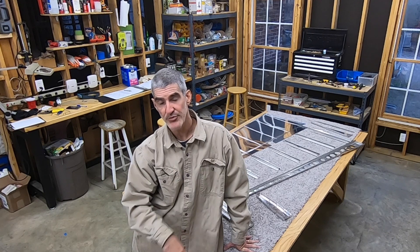I've completely disassembled everything. I've deburred all the holes in the skins and the skeleton, gone over the edges again, made sure those are all nice and deburred. The whole thing took me about three hours or so. I'm going to go ahead and start dimpling the skins now. I'll use the C-frame for the holes on the insides of the skin where the squeezer can't reach, then pull them back over here to the table and pull out the squeezer and start dimpling the edges of the skin, the stiffeners, the spar, the ribs, and get all that taken care of.